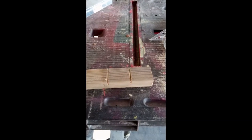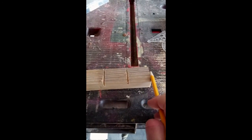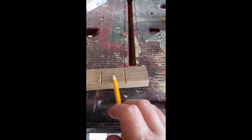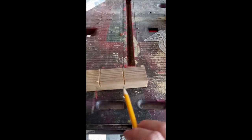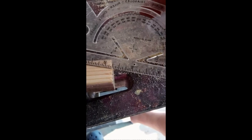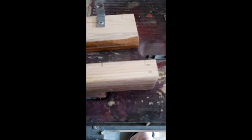You're going to want to give yourself about an inch and three quarters from here to here, so we'll have the ability to cut a hole in here and to taper it off. I'm going to cut this about a half inch from the slot here, and then I'm going to draw a line from that half inch mark to about the middle of the board to make our ramp. So we're going to cut this quarter inch deep.